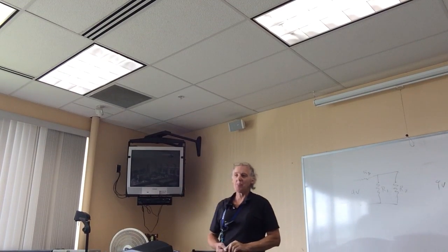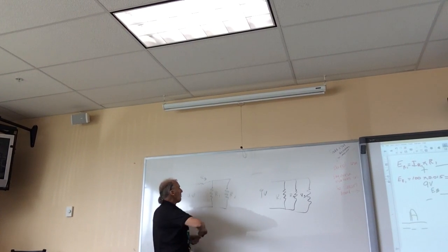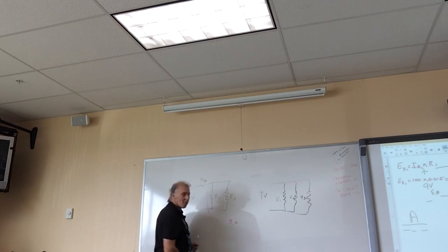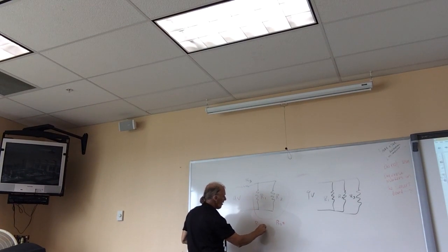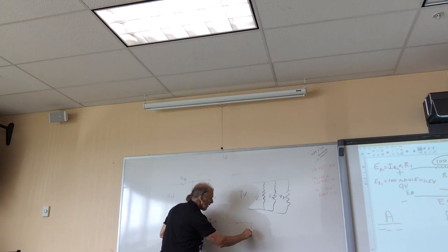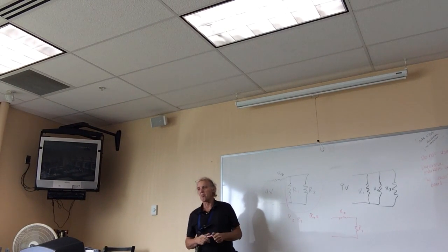But you're asking the wrong question. Think about your circuit. You're going to solve this much of it right here, right? And you're going to call this RT when you solve it, right? So your question to me should be, does that mean that R3 and RT are in series? The equivalent circuit is going to look like this: RT and R3, and then you'll solve that circuit. That's why you have to show your equivalent circuit.